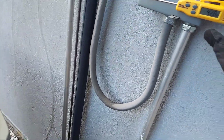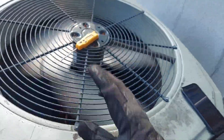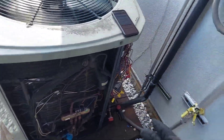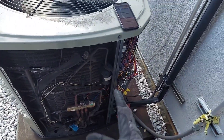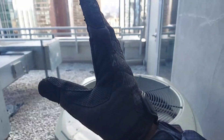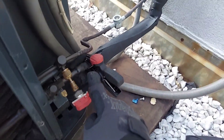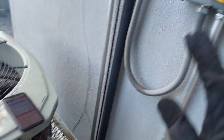Currently it's 42 degrees outside, maybe a little bit colder. You can see 42 degrees going into the coil and leaving the coil at 25 degrees. So we're picking up heat from the cold air outside — that's pretty much how a heat pump works. The reversing valve, or the 4-way valve, switches the system around so that the outdoor unit, as opposed to rejecting heat outside, is absorbing heat from outside. The heat it picks up gets sent through your suction pipe to the indoor unit and rejected there.